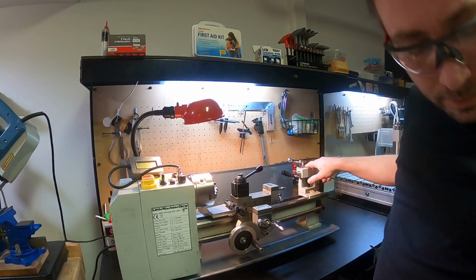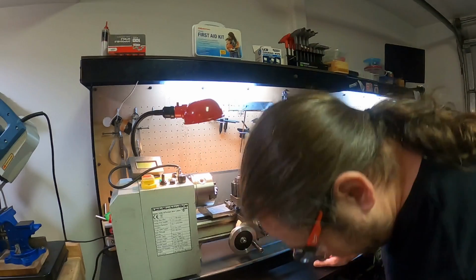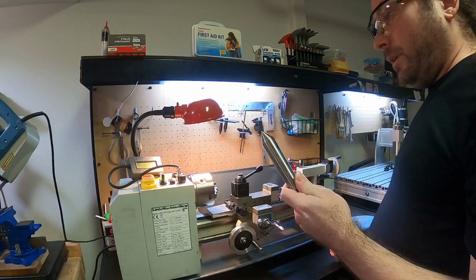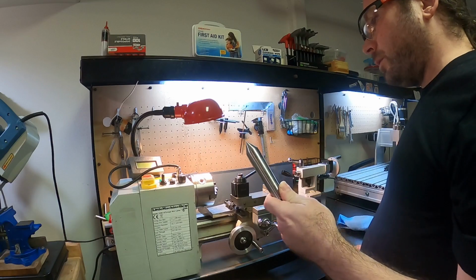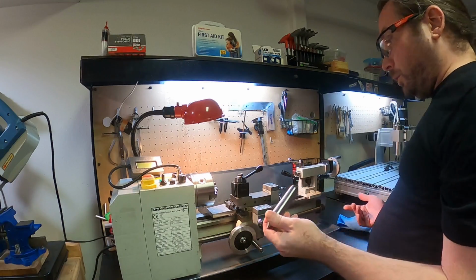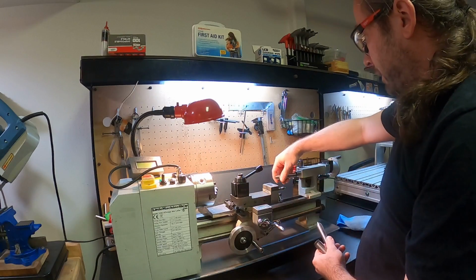So the thing that I just moved, let me see if that's even in frame here. Okay, it is. This is the tailstock, and you can mount various things in the tailstock. So there are different types of tapers. You'll either see them fully written out, their full name, or like an abbreviation. So, Morse taper, or MT, that's a pretty common one. So there's a 3 or 2. This one would go into this end, and these that I have can go in the other, into the tailstock.